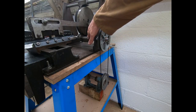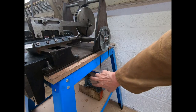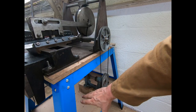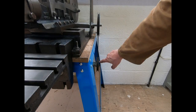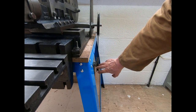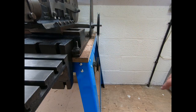We've got the pulley that drives the rear mechanism to apply the power. What I've done is put in, for want of a better word, a lay shaft — so that will turn this one, and this one will turn this one. On here we're going to add some pulleys and then have a motor there. We've got enough gap between the side here to run down to this lower lay shaft, so I think that's going to serve us well to apply power to this.